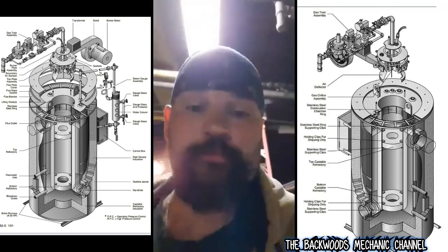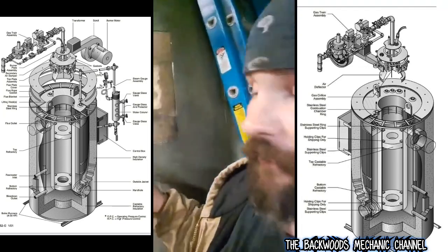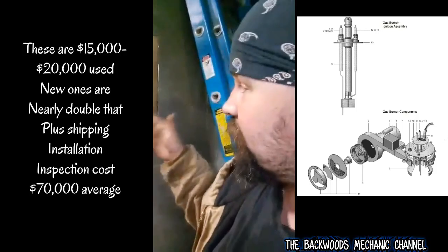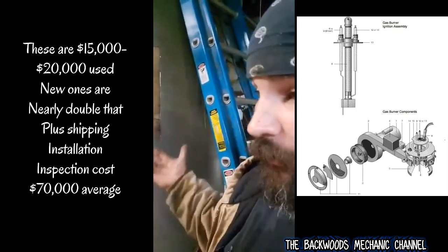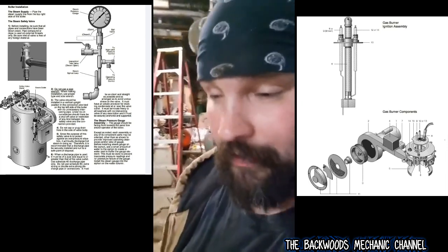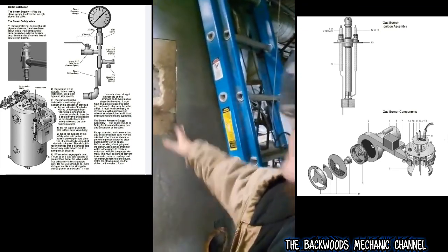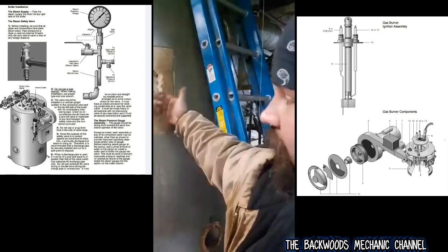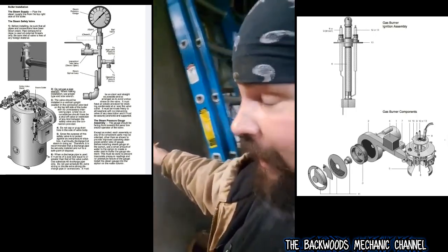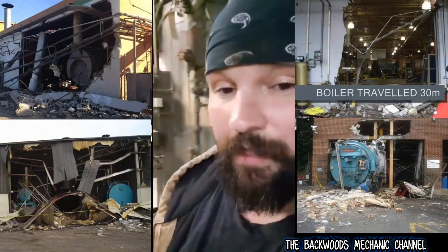In some cases you can just buy a whole new boiler, which nobody wants to do. When they looked at it and we told them what we'd changed, they had a theory: we likely changed the right part, but it could have been leaking around the threads all weekend - this place shuts the boiler down Saturday at noon and doesn't restart it until Monday morning at five. So it could have been leaking all weekend, getting the insulation wet, and when it gets hot the pressure builds up and starts steaming because it takes two or three days to dry out.